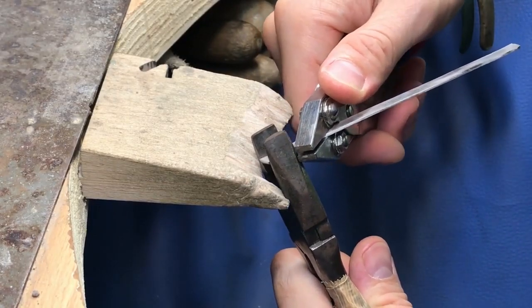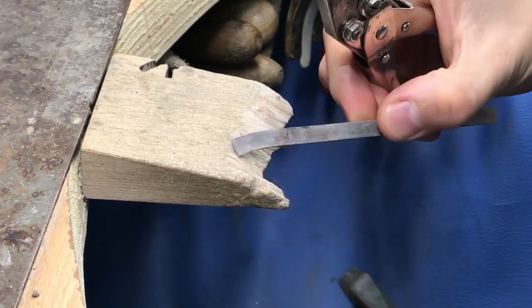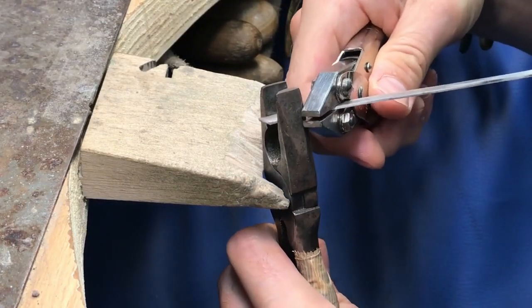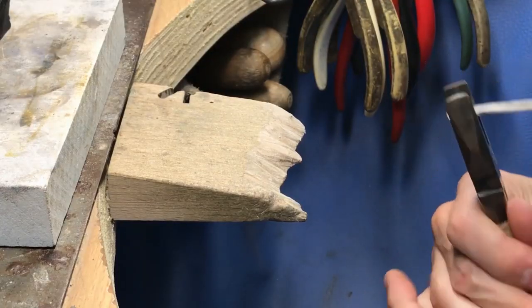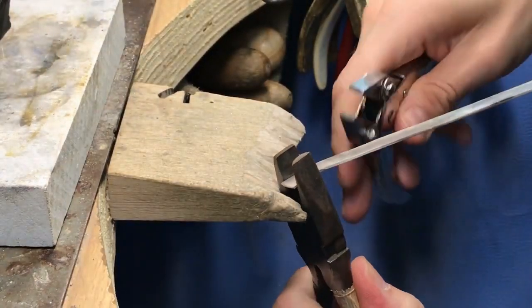You can see on screen I've got a really extra deep bit of metal there, which is difficult to bend without it kinking or twisting. So it's extra wide pliers which I recommend you get — these were homemade, just grinding down one half of a big pair of old pliers.